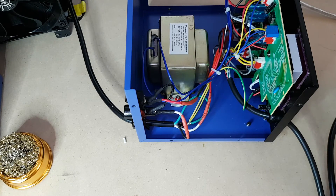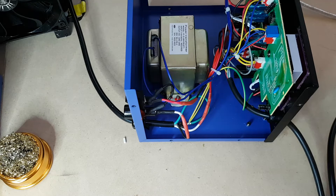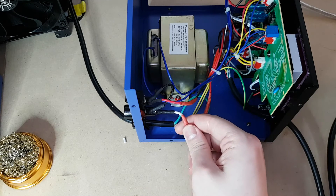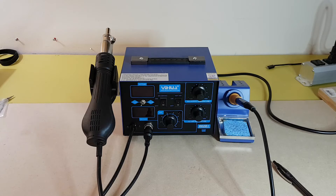It's a fairly easy mod — it's really just snipping those three wires and making three solder joints, and that could potentially save against a fire or electric shock, so well worth it. But again, be very careful: it is the AC side. Make sure your joints are good. I'm going to do a smoke test now — turn it on, make sure it still works.